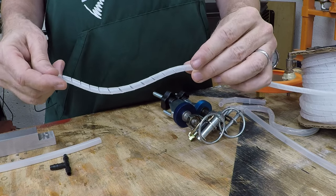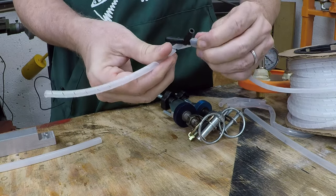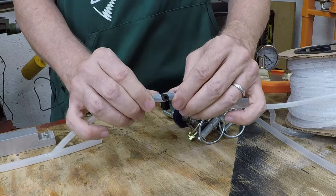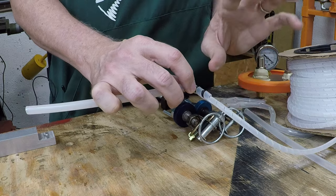There are a couple more ways to get your vacuum tubing into your vacuum bag. One is fairly similar — you punch a hole through the vacuum bag but instead of using a port you do a slightly different method. In this kind of situation you're probably going to use a spiral tube. What I've been doing is sticking a T into my spiral tubing. I do some extra work to protect the vacuum bag from the edges of the spiral tubing, but the tube coming out of your vacuum bag gets put onto the T and pushed down tight. Let me show you what the end result looks like and then we'll talk about the process.